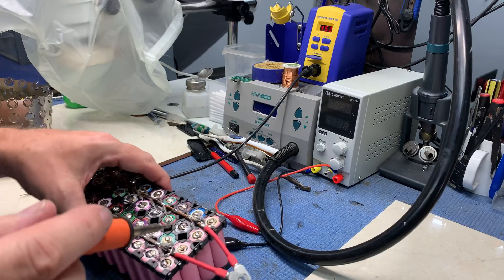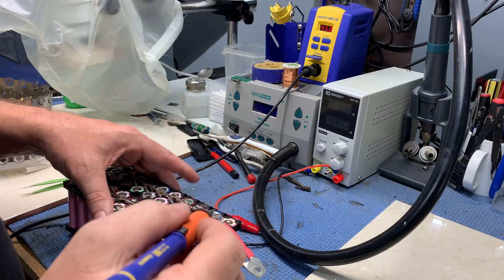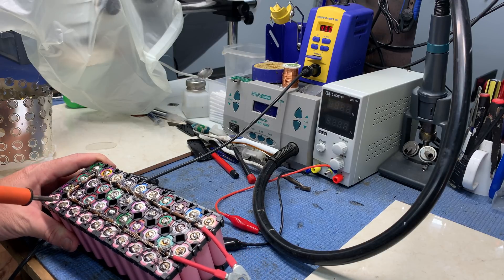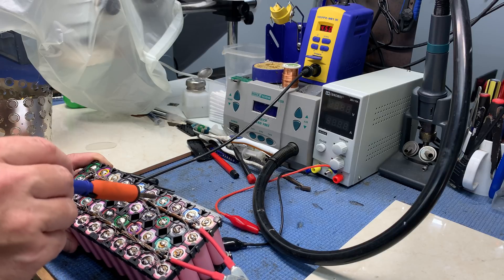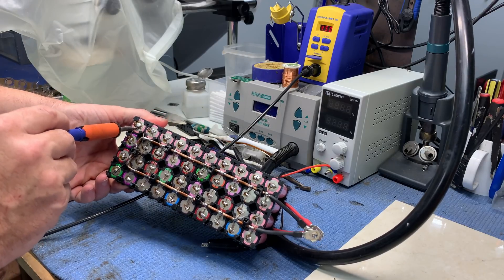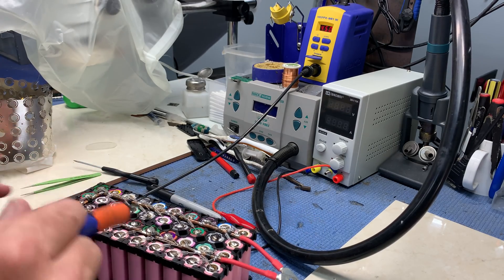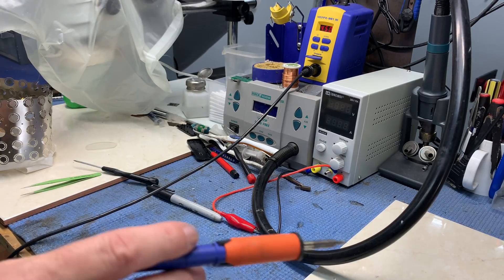So these are the five fuses that failed. Looking at some of these here, some had blown fuses last time, including that one, that one, and indeed that one. There's only one that didn't have a blown fuse on that side, but it had one on the other side. There's what might be a black mark — could be flux — but there's no consistency between which cells it is. So let's test those fuses.